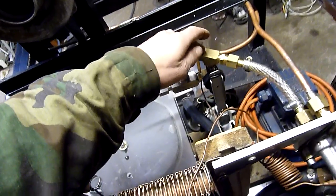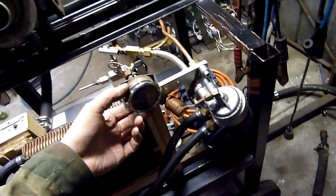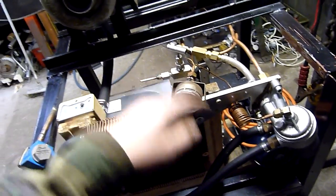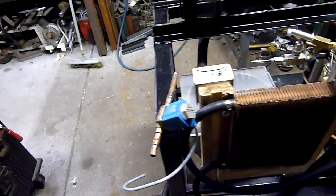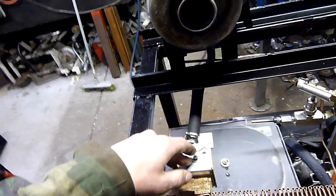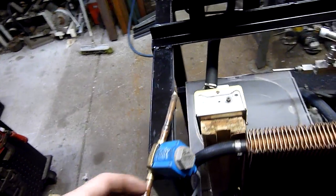So I've got high pressure in through there. I'm going to put another gauge on here, on the discharge side of the pump. I've got a gauge on the outlet side of the oil filter as well, to give me a high or low pressure reading on the inlet and outlet side. I've also got a cutout switch, just in case things go critical — this will cut out at 90 psi and shut things down.